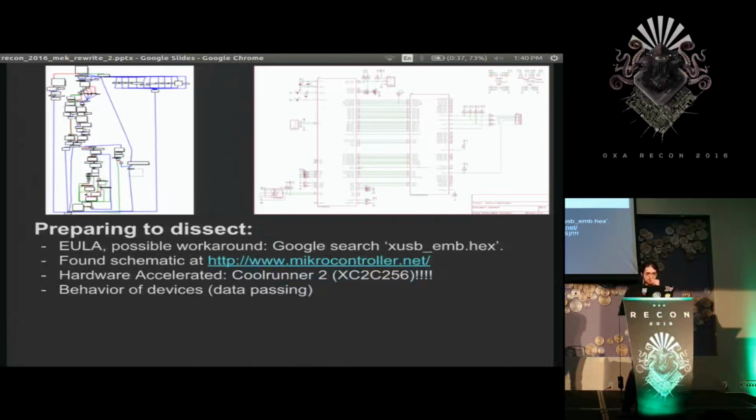And before we get into actually how the software works, I want to point out that the way this works for the hardware, and why it's able to be so fast, is that all the data that comes down through USB gets piped straight into the chip and moved over to a general purpose IO, like scripted interface on this chip. In the FX2 chip, the USB one, it's able to run waveforms with a state machine against whatever other chip it's attached to, in this case the CPLD. So it literally takes the 16 bits of data we send over USB in groups, takes one 16-bit group at a time, puts it on the 16 data pins, sets a mode, enables it, and clocks it until it says it's done. So the CPLD is actually doing the individual JTAG work, but there's still interfaces between the FX2 and the CPLD, which is doing the hardware acceleration, that we have to understand. Okay, I guess that's mostly that.